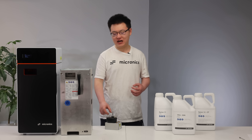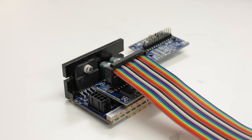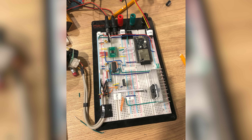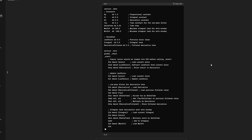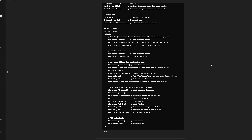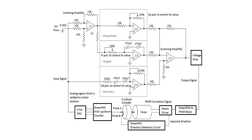At this point, we also decided it was time to start building our own galvo system for better accuracy and higher print speeds. Most of the error in our off-the-shelf galvo comes from the poor quality controller, so that's where we decided to start. Initially, we tried building a digital controller on the breadboard, but quickly realized that the signals from the galvos are very sensitive to noise and EMI. This caused a lot of inaccuracies. Moreover, programming a microcontroller to run the control loop in real-time proved to be quite challenging. Therefore, we went back to the drawing board and started work on an analog control loop.